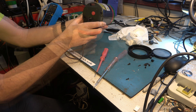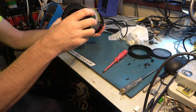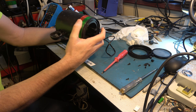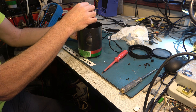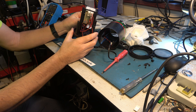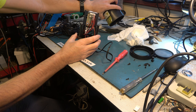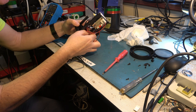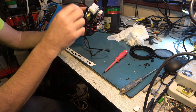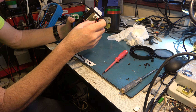Maybe I'm pulling on the wrong thing. Aha! That was it. If I can just pop the opto sensor out or unplug it. Now I don't know if it will work all the time without the opto sensor or not at all without it installed. Now we have good access, we can find out if there's any voltage to the motor. They're labelled green, red and motor — very well labelled, nicely done actually.